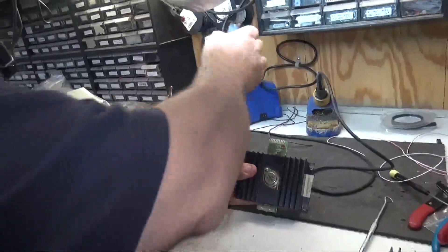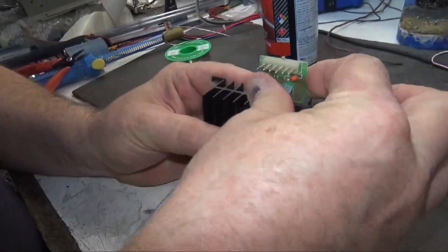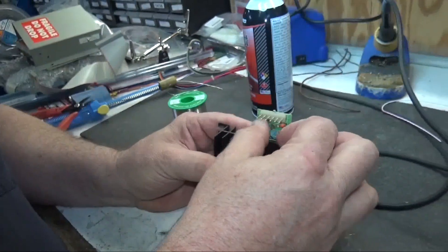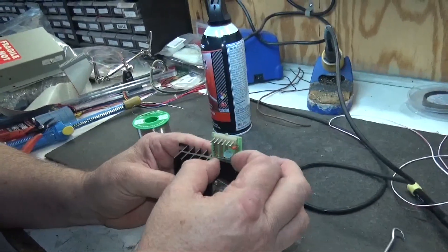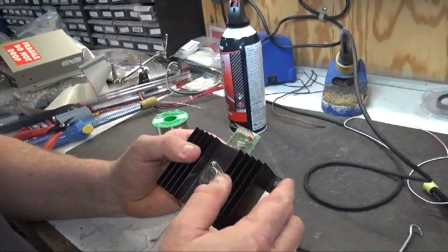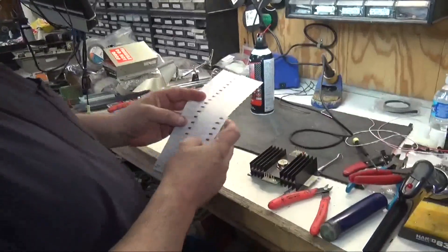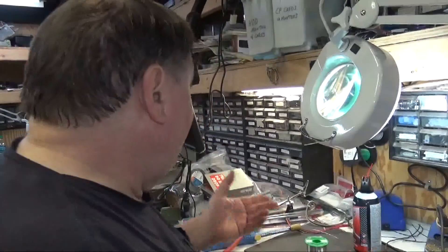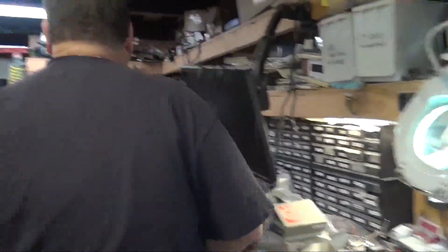...is you have to squirt the five volt adjustment pot, and then you spin it around and around like that. Now I'm going to guess roughly where it was before we turn the power on or connect the game — it was about right there. That's about the point it was. Now the last thing we do is take one of our stickers — where's the pen, Frank? This is supposed to be pre-setup.